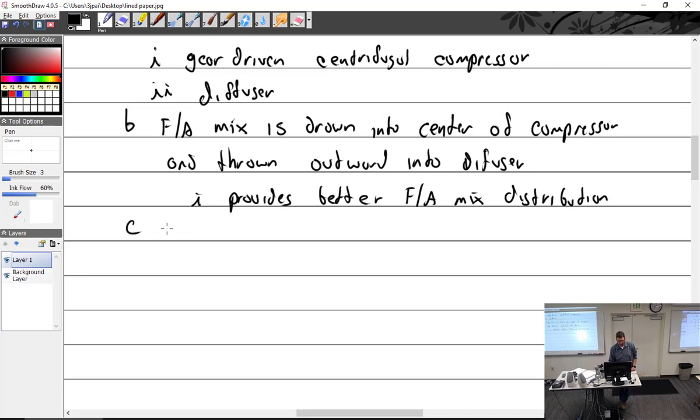From the diffuser, what would be the next thing? Right, intake pipes, very good. So it's a fuel-air mix? Fuel air, not just air? For the intake, where does the fuel come in? The carburetor bolts right to the engine, right before the supercharger. So what if it's fuel injected and just goes straight? It's just air then. Radials never had fuel injection that I'm aware of. Oh, these are specifically on radials?